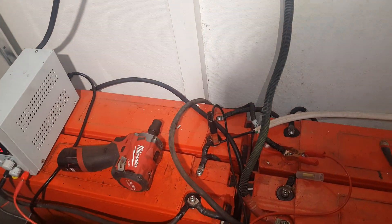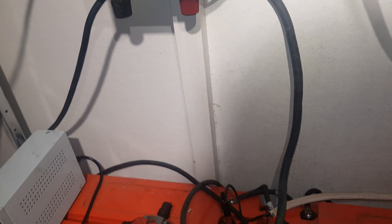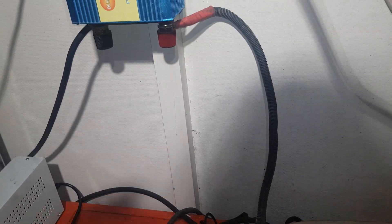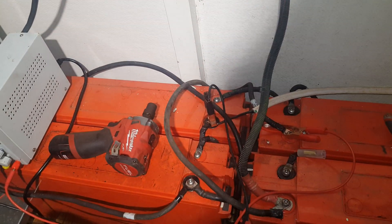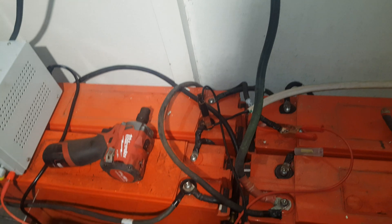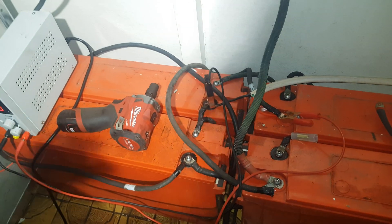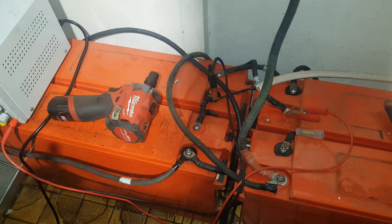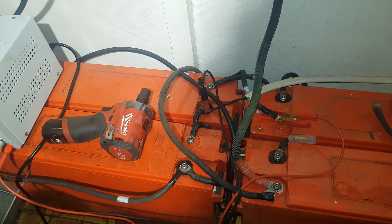How are we going to improve on this system? I've got to go up to Solar Tasmania and get a battery disconnect switch. I want to put a board on there so I can screw stuff to it without affecting the backing board anymore. We need a battery disconnect switch with multiple fuses, cable lugs, some cable to make up proper jumpers and things like that, and we'll have to replace some of them. I need to mount the other three panels on the roof — I've got one 250 up there now, high voltage 250.